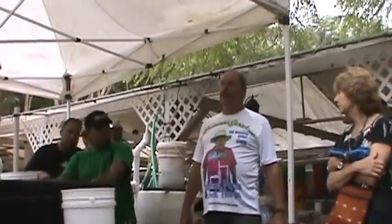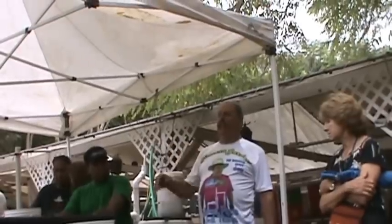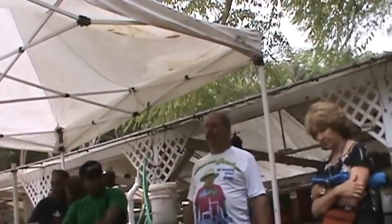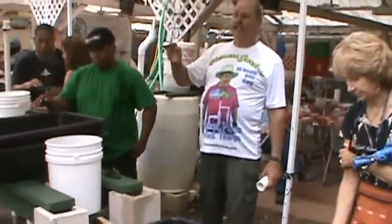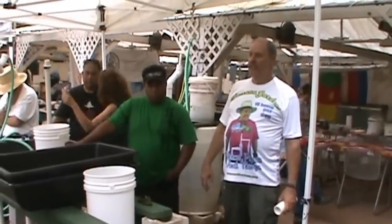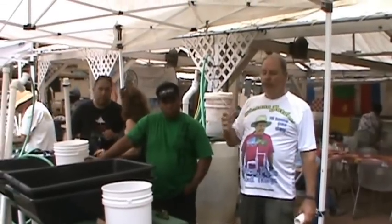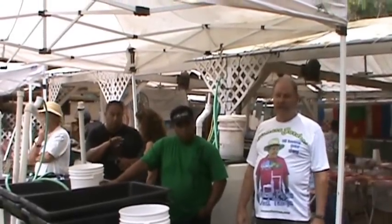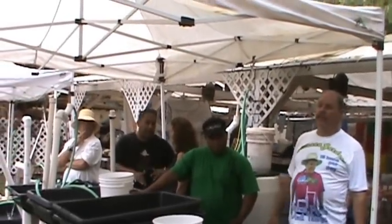They pump 1,200 gallons a minute coming out. I got to drain a 6,000 gallon bed in 3 minutes. So I have to have like 5-6 of them going down to drain it that fast. Because you don't want to drain slow. When you drain, it's like a toilet. You want your toilet to flush slowly or rapidly? You want it to kick butt and get gone, right? To move solids in water, the water's got to move at 5 feet per second. Otherwise, the solids drop out. So when we flush these things, we want it to really move.